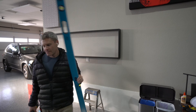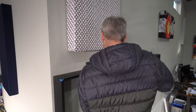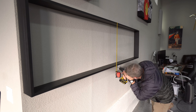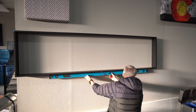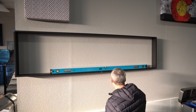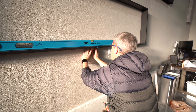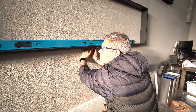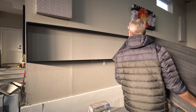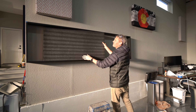Where I ran into an issue was my plan to just use one pocket hole screw on the bottom going into a stud toward the center, to help provide support so that the bottom eight foot board wouldn't bow. However, when I drove in the pocket hole screw it lifted it a bit so it was no longer level — it was actually making it thinner in the middle than on the edges. The way I fixed it was I just chopped a little piece of wood up there and used that to get it perfectly flat and level, then screwed that directly into the stud. Now I was ready to start dry fitting my foam.